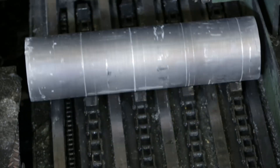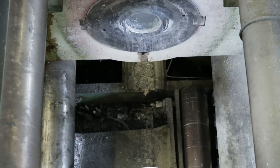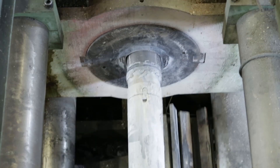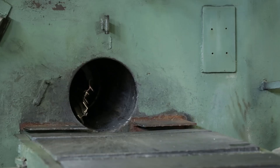The hot 30-inch billet is fed to the extrusion presses by the extrusion loader. A large ram then pushes the billet into the container and applies as much as 3,000 tons of pressure, which squeezes the aluminum through the steel extrusion die.